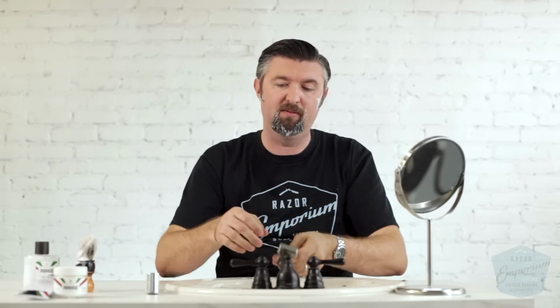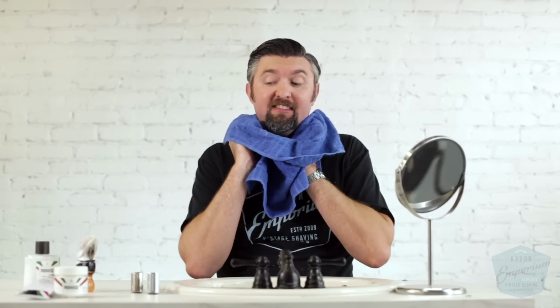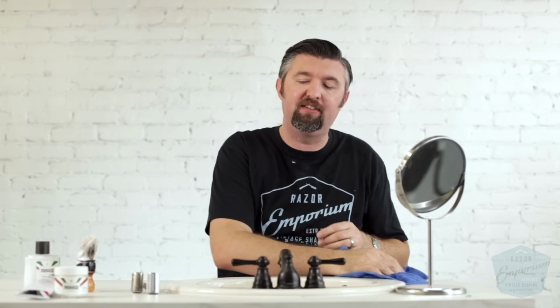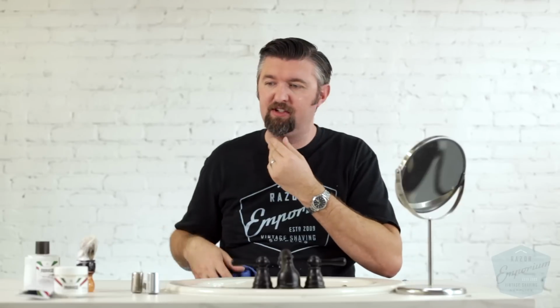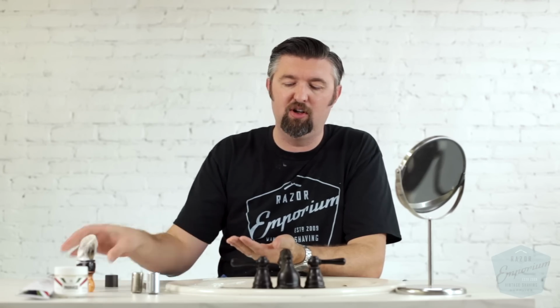I've often said that the original Gillettes are pretty much impossible to beat in terms of their quality of construction. With the stamped brass, you could have, and often would have, 100,000 pieces stamped, and you could look at them, and the stamping dies were so well made and so well hardened, and the setup process for the progressive stamping machinery in the Boston factory, that the parts on Gillette are just completely interchangeable. They are completely identical images of each other. Casting is nowhere near that precise. Casting is close, but even the best of casting, unless you're doing metal injection molding, is just nowhere near what stamping is.